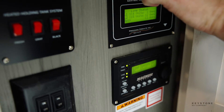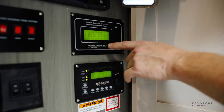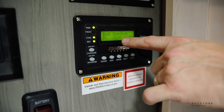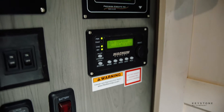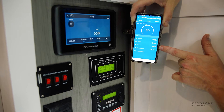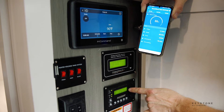So if I shut some stuff off, go up here to my HVAC and turn this off — you can see that the load has gone away. I have zero amps because I've shut my air conditioner off. Now I'm bulk charging down here, my charger light is solid and I'm putting power in. This is metering net, so you can see here this 655 watts is what's going into the battery. If you wonder how come this says only 49 amps here and this says 65, it's because the rest of these lights are taking that extra difference in between.